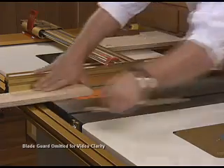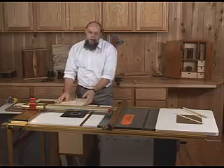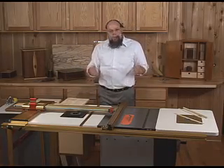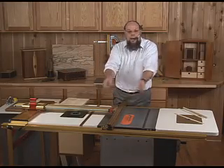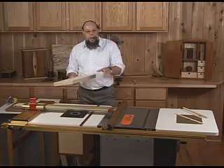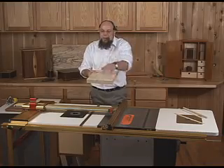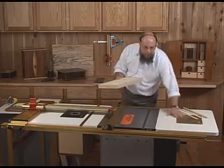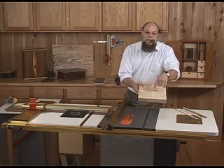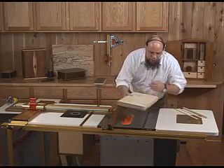One of the first things that people discover about the INCRA systems is that they're very efficient to use. Because they align perfectly against the blade every time that you lock them, you measure once and cut, instead of measuring the front of the blade, the back of the blade, and everywhere else before a really important cut. That efficiency is good, but when it's time to start gluing things together, what really matters is how close to each of those three dimensions you actually got. We know for a fact that four inches and six inches always adds up to 10, but only if each of those three parts is perfect on its own.